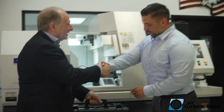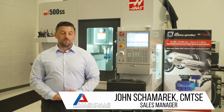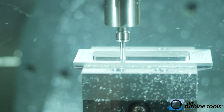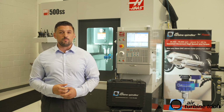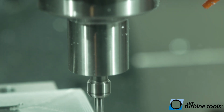I am John Shamrick. I am the sales manager at HAAS Factory Outlet, Allendale Machinery. I've worked here for about 7 years, and of that time, I've gladly introduced my customers to Air Turbine Spindles. They've been able to take any of our HAAS machines from their standard RPMs up towards 90,000 RPM without sacrificing any power by using only 90 PSI shop air.